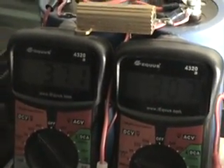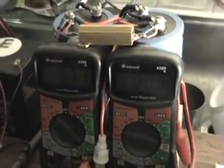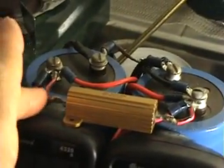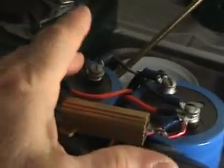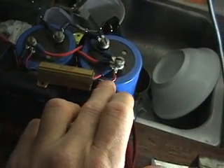We are drawing a total of 30 milliamps. For those unfamiliar, this is a very accurate meter I built specifically for utilizing DC in pulse circuits. It has two 3700-microfarad capacitors. The batteries feed the first capacitor through a high-precision 1%, 10-ohm resistor rated at 50 watts, which slowly transfers current to the next capacitor where the H-Bridge is connected.